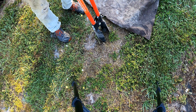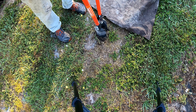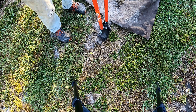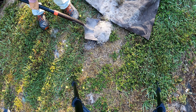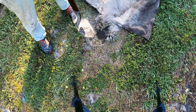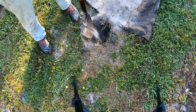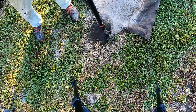We're going to start with the post hole diggers and dig two holes. Not going to worry about sod — we're just going to get down to that hard pan. You can hear me hitting it right there. The hard pan is a non-permeable soil, meaning water won't pass through it. We need to get down to that hard pan and a little bit below it for this system to work.